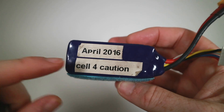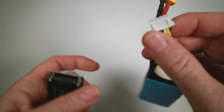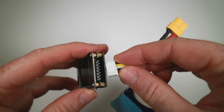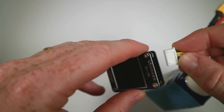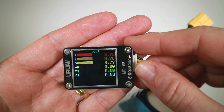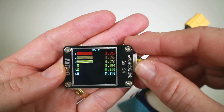Here's a battery which seemed to come dodgy when I first bought it three years ago, and I wrote 'cell 4 caution' because it came delivered looking a bit worse for wear — and lo and behold, this is a four-cell battery and you will see that cell 4 is no more. Which is a useful diagnosis tool — seeing if one of your cells is out of shape is quite useful.